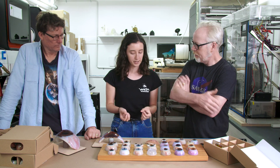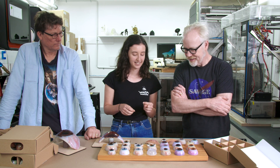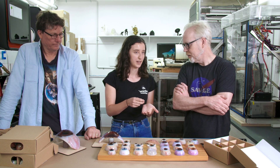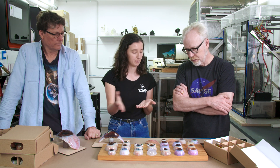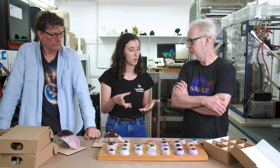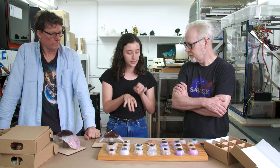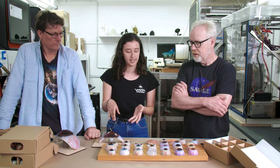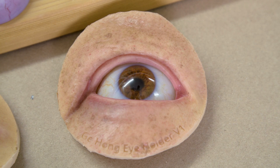So I've used this third method called voxel printing. A voxel is a three-dimensional pixel — and in this case, it's also the term for a droplet of material. The printer has six materials it can load up at once: CMYK, white, and for these eyes we put in a clear material. Those can be dotted together to achieve all of these colors, so each eye is made with a combination of clear, CMYK, and white pigments.